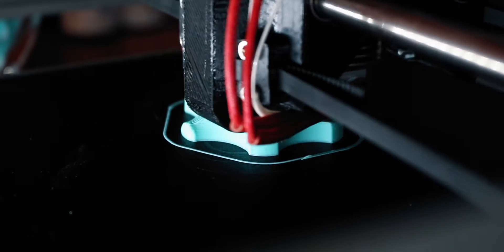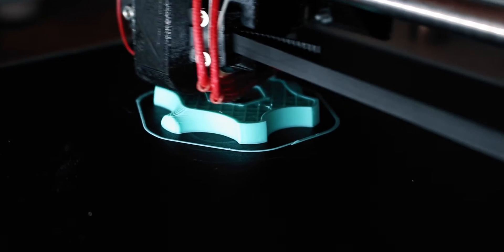So basically instead of using acetone as a solvent, we're going to be using rubbing alcohol or isopropyl alcohol as our agent. Now Polymaker does sell their own special machine just for smoothing their prints that they recommend using, but I want to see if we can do it using the same method we would with ABS plastic, except using rubbing alcohol instead of acetone. I purposely chose a fairly high layer height because I wanted to really see how far we could push this smoothing aspect.